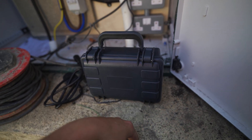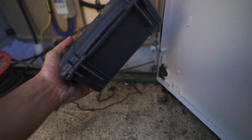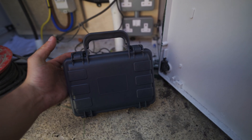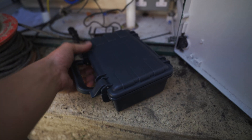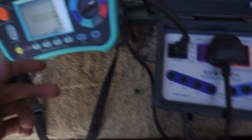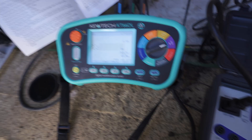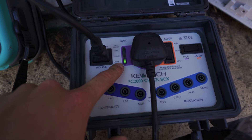It's a tiny, diddy little thing but it's great for checking accuracy and making sure you're up to date. If you've got a lot of testers in a company, it's just great to prove the accuracy of them all. So I've got my tester set up, three leads in, plugged in. We're on RCD mode, doing 1x at 30 milliamps. I'm just going to press test.